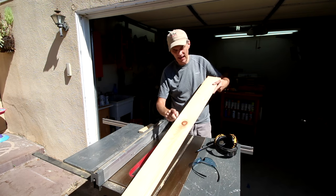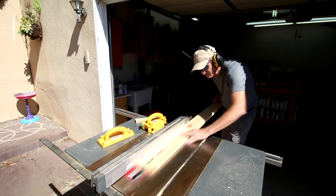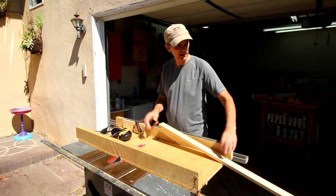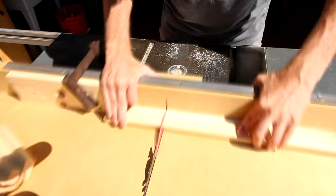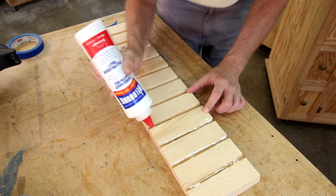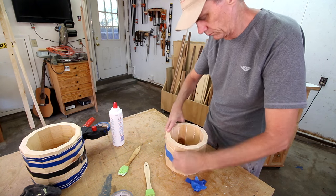This time I'll glue together the edges. I'll cut this into one long strip two inches wide with 15 degree bevels on each edge. I've got my blade straightened back out and I'm going to use my big table saw sled to cut this board into 12 pieces. The trade-off by using this method and gluing the edges together is that the joints will be stronger, but the faces of the frames will be end grain, which may be a look that you don't care for.